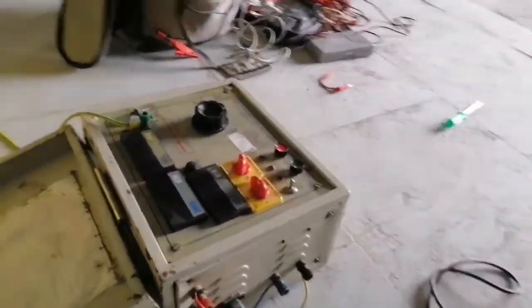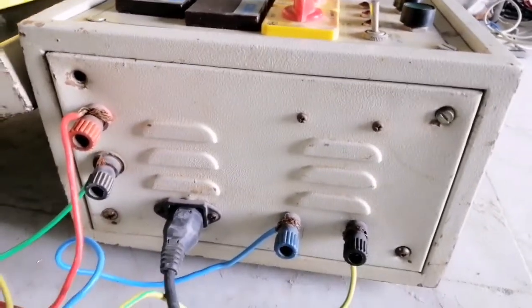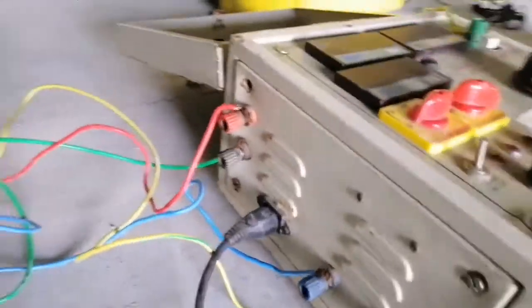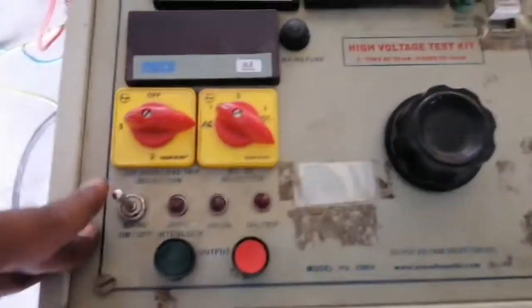This is the HV kit. It consists of four terminals. And this is the control unit for the HV kit, which also consists of four terminals. The red and black terminals are for stepping up the voltage and blue and black is for measuring the leakage current. It should be connected to the HV test kit. The HV control unit has an AC/DC voltage selector switch and an overload protection selector switch to trip the kit in case of any overload.